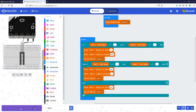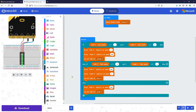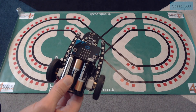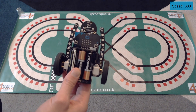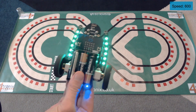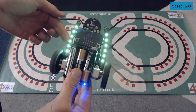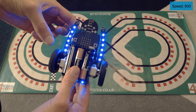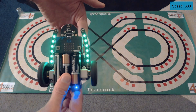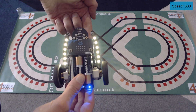We're going to download this — I'll call it 'bitbot' and download it. This will package your program into a file and download it to your computer. Then I send this file to my micro:bit and slot it into the BitBot. Turning it on: it should go green and drive both motors. Covering the left line sensor, it turns blue and just the right motor spins — turning right. Checking the right sensor, it turns yellow and just the left motor spins — turning left. It seems to be working!